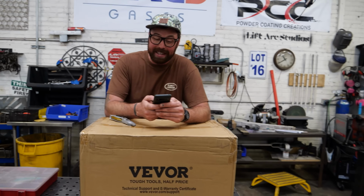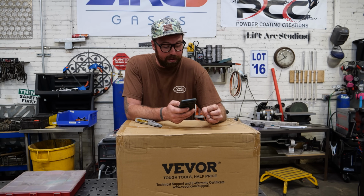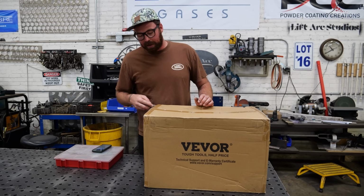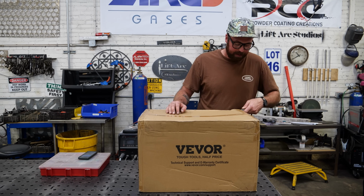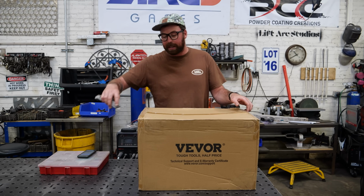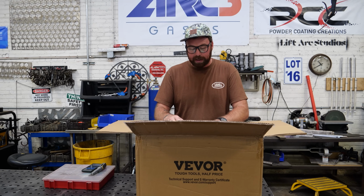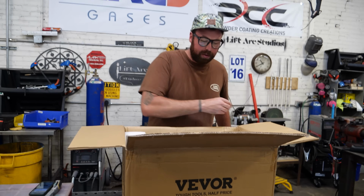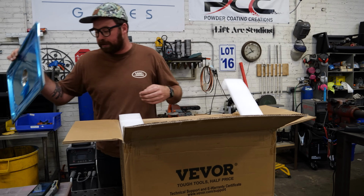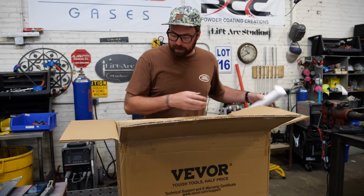Now, what an ultrasonic cleaner is, it utilizes high frequency sound waves to create cavitation bubbles in a cleaning solution, which then implode, dislodging and removing contaminants from submerged objects. Cavitation is interesting. It's something to do with the physics and tension within a fluid. If you displace that fluid faster than it can move in to fill the empty space, then an air bubble forms seemingly out of nowhere in a place where there is no air to begin with. Cavitation is also what kills pumps. If a fuel pump or a water pump or any sort of other pump experiences a lot of cavitation, because of that bubble implosion, it's very detrimental to the metal parts inside the pump. So the physics are sound and it should work.